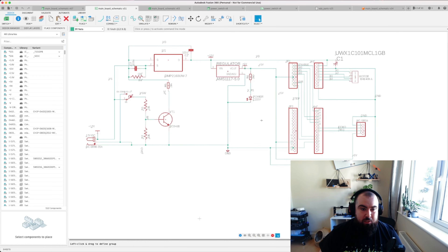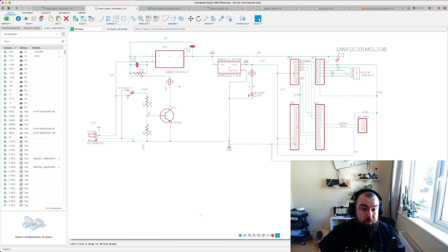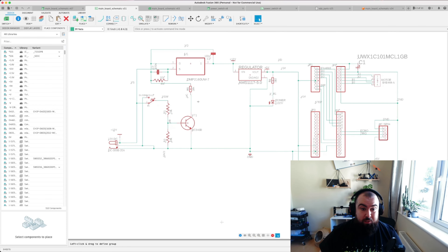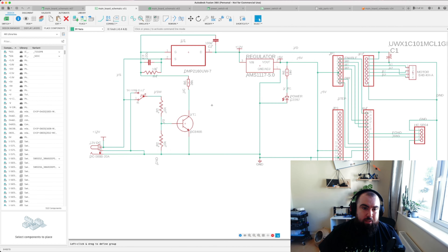There are things to do with the notation of components, which can be a little bit confusing. One of the single most difficult things about laying out boards is the components. These tools are kind of open source and a lot of people contribute components to them. But in the real world, you would basically build up your own set of components and make sure they match all the electrical characteristics you want — right part numbers, right footprints, and that sort of stuff.